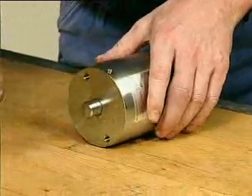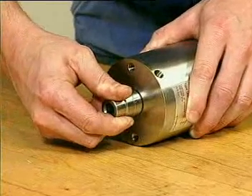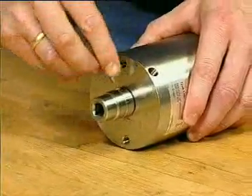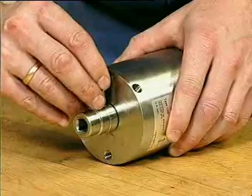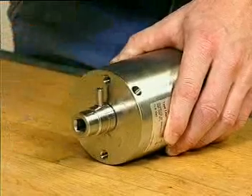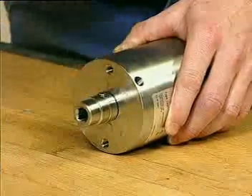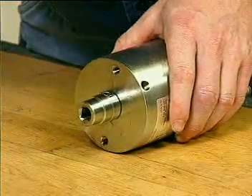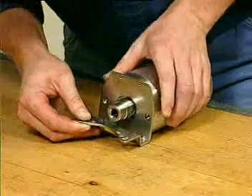Fit the coupling on the rotating cylinder stem. The hole for the screw in the activating ring must be opposite the air release hole in the air cylinder: 135 degrees clockwise for the NC actuator and 225 degrees clockwise for the NO and air-air actuators. Fit the connex pin. Fit the bracket and bracket screws and tighten.